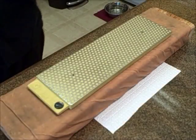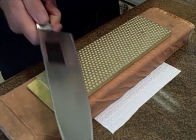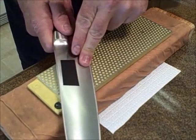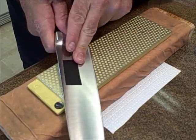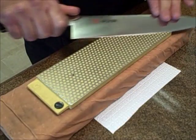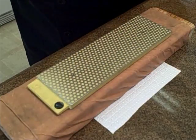I'm going to show you the Western style of sharpening, and basically it works like this. We lay the stone, we raise it, we move it forward till we find our angle when it bites, and lay it back. Here we are, the same way we did with the Japanese sharpening. And then we follow the shape of the blade.